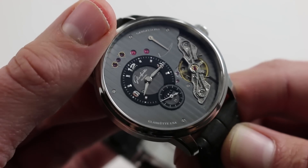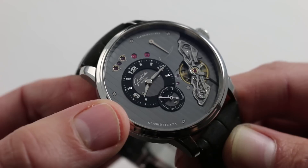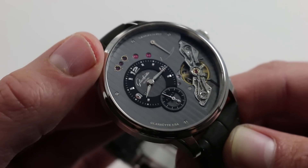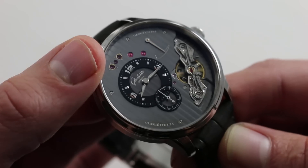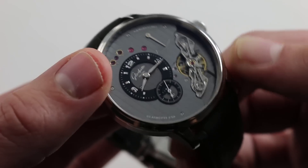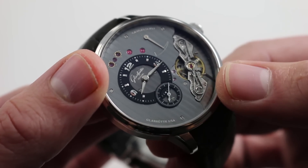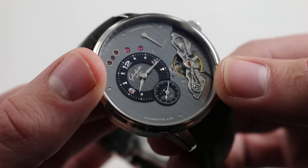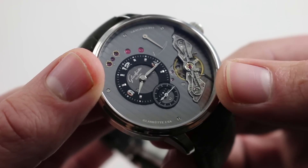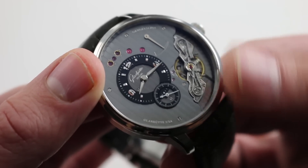Notice that the caliber 66 emulates the three-quarter style bridge that is dominant in Glashutte watchmaking, whether it's from Lange or from Glashutte Original. This is a style that recalls the pocket watch heyday of German watchmaking in Saxony. Also note the double engraved balance bridge. Normally you see the balance cock — a single-sided brace supporting the balance assembly. Here, because of the duplex double swan's neck regulator, you get a full balance bridge with each side individually engraved by hand.